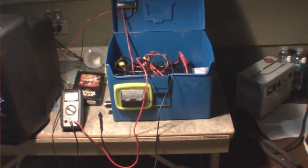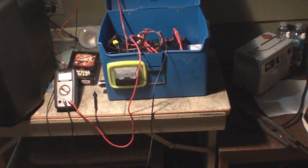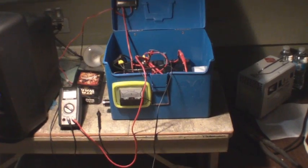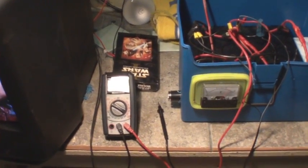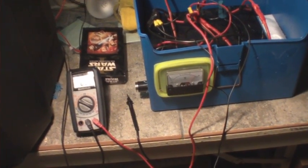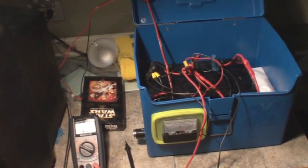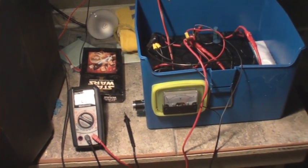For whatever reason, sometimes it doesn't take out all the rest of the batteries. If you run them through four or five cycles on a Bedini or a Tesla switch oscillator - a Bedini-style, which I prefer - you bring them back up. Those batteries there are what I usually call a 12.9 battery - in other words, when it charges up and rests overnight, it just sits at 12.9 or 12.99, something under 13.